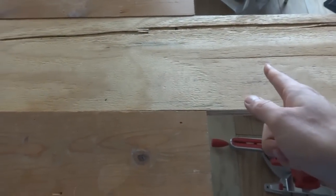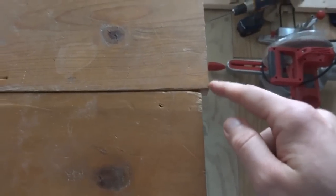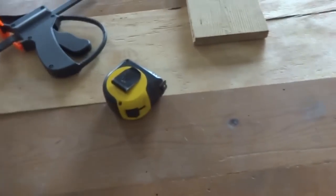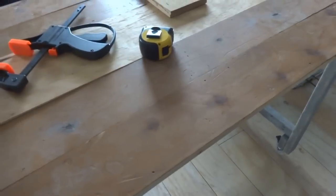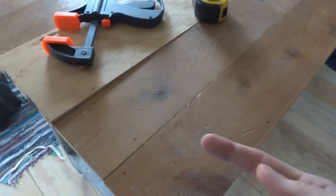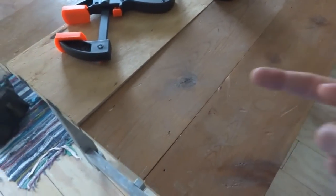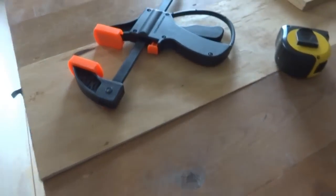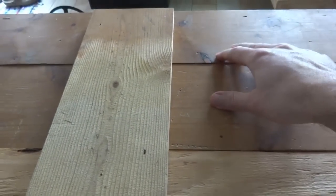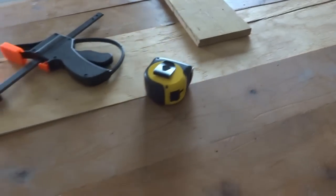Obviously I need to cut the plywood down and sand it because it's going to be a little rough. And a couple of these floorboards are a little bit long, so I have to trim them down by 1/4 inch or so. But I plan to join them with the pocket hole kit from my little Kreg jig. Almost exactly like building a frame, you drill in the pocket holes on a couple of boards, add a little glue and you screw them together and they become nice and tight. You just got to make sure that they don't bow like that, so I have to make sure to clamp them and weigh them down as I'm doing it. But it should turn out pretty cool.